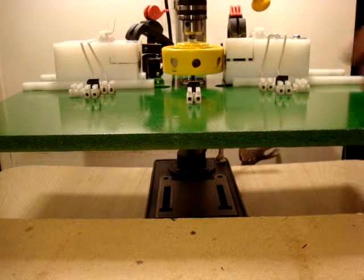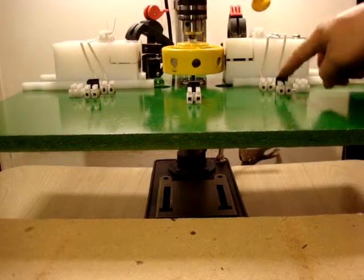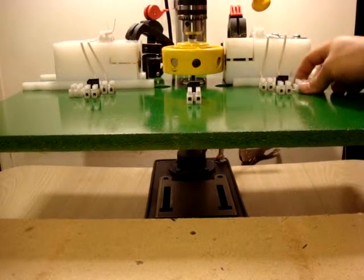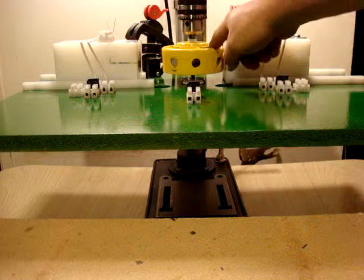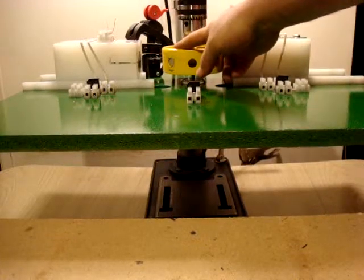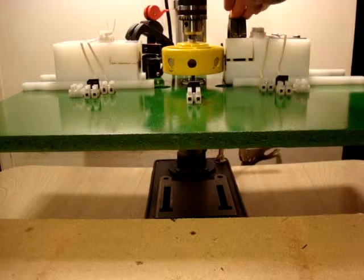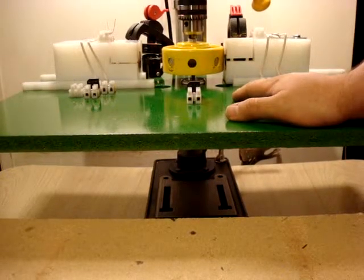This wire coming down is the small wire on the coil. The back wire comes over and down, goes through the rectifier, and we also have our AC port. The other connection is for the large wire on our coil, then we have our AC output and DC output. Our other coil is far away because we're doing a one-coil test right now — just testing the output of this coil. We have four magnets inside the rotor and we're running at 3,000 RPM. Everything is bolted down, the coil is clamped, and the drill press is clamped at the back of the table.